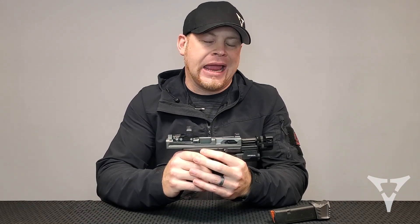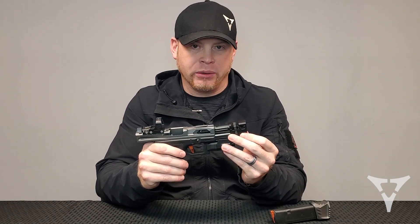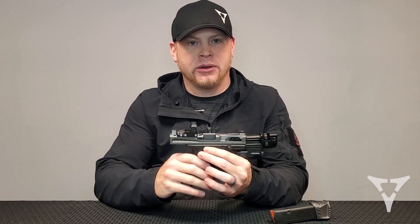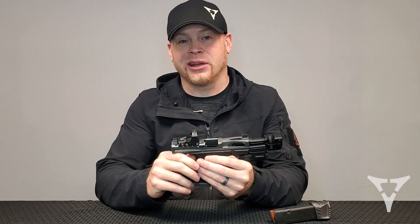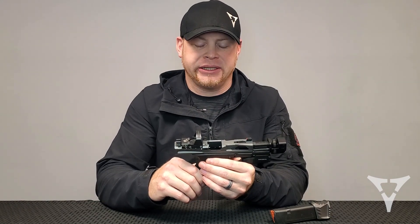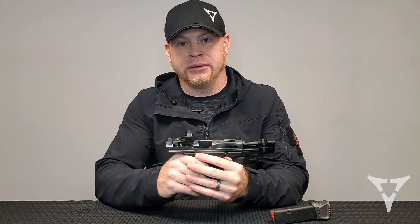The other thing we want to go over is the ammo. We did not tune this compensator to eat everything, because if we did the really weak stuff would work okay, but the really hot stuff would feel like there wasn't a comp on your gun at all. So we had to tune it to the middle to the top end of the power range. We test here in the factory with American Eagle 115-grain ball ammo and Cabela's brand Herters 115-grain ball. That's what we test and tune with. If it's not running with those two ammos you've got other issues. It loves plus-P ammo, so if you're carrying this for defense you want to make sure you're running plus-P.